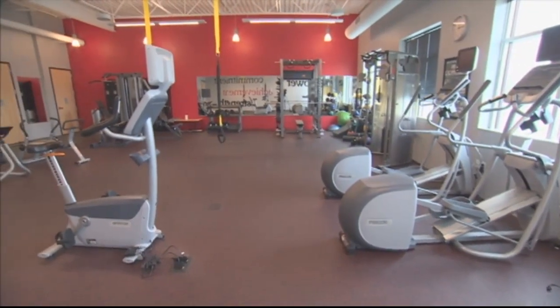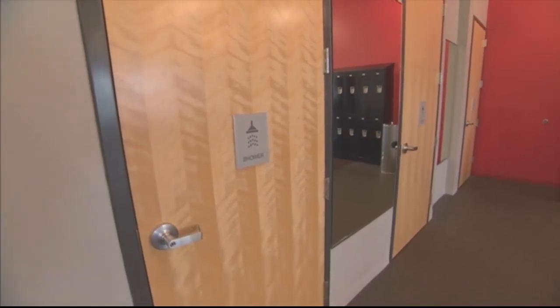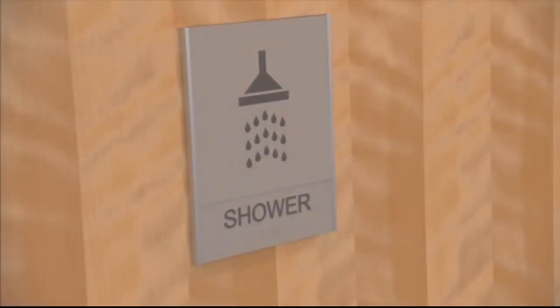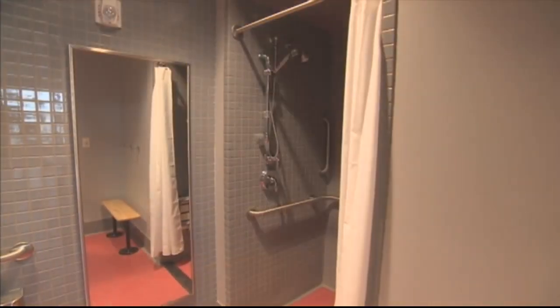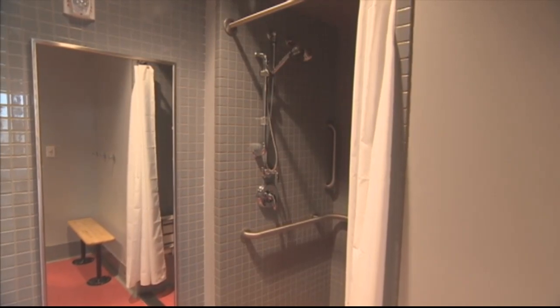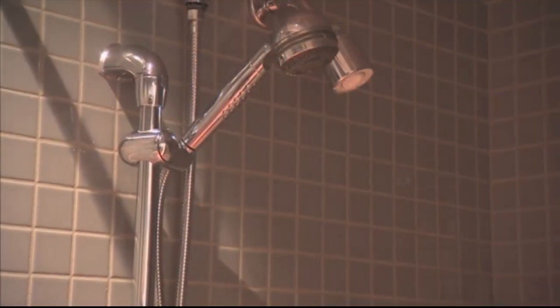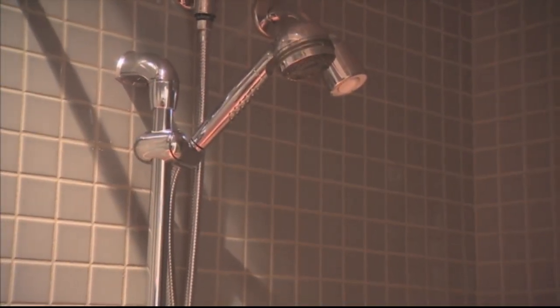So that's where I look at it if I do a risk assessment on a building, and we can use our building as an example. We've never been completely shut down, but we've been partially shut down. We have a fitness center in here, and that fitness center hasn't been used. So that's an area that could be concerned. It all depends how everything's piped with different buildings, but if it's not being used, it's sitting, it's getting stagnant. So now we open right back up, don't do any precautions, and you have a shower in there. That shower makes it an aerosol and someone could then breathe it in. So you want to make sure you're following the right standards, taking precautions and not just opening your building right back up and potentially exposing your employees, customers, clients.